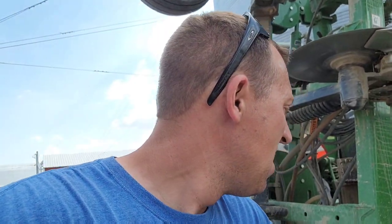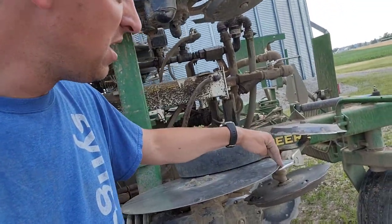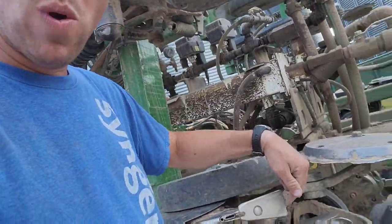I know that the people that we bought the bar from did not ever replace the blades, and they bought it used, but it couldn't have had very many acres on it when they bought it if it had 3,800 when we got it. So I think it's probably going to be a every 2 to 3 year thing that we're going to have to replace blades and boots. And like I said, these beaver tails seem to wear more. We'll probably end up replacing them every year at the least, and maybe even once during the middle of the season as well. So we'll see.